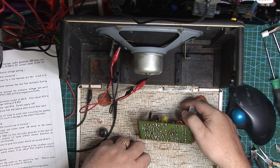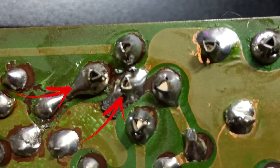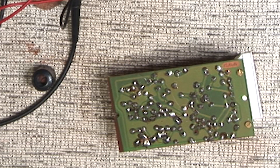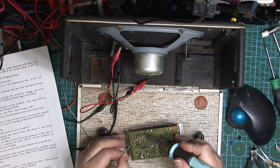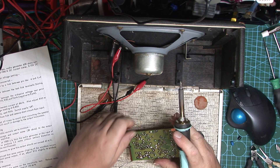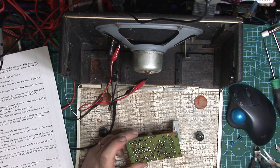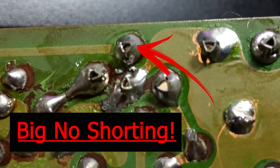The easiest way to do that is by turning it over, making sure you get the right pin — this outer edge one here and the center pin like that. It only needs to be an old capacitor leg or something like that. The easiest way I found is to just put a dab of solder on that pin to hold it in place, stretch that across, and cut the excess off because I don't want that bare wire touching this track, which is actually the live track. So we've shorted that out.